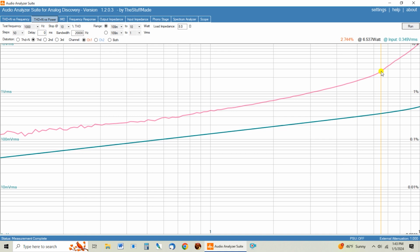And so that's when the amp starts clipping. So again, and I know some people argued about this with me, but I'm not going to say that 5% distortion is the power level. And I know some people rate amplifiers by how much power they make at 5% distortion. Every amplifier that I've tested on my channel, I've gone by how much power is it making before it starts clipping. And to be fair, every amplifier needs to be judged on that same criteria.